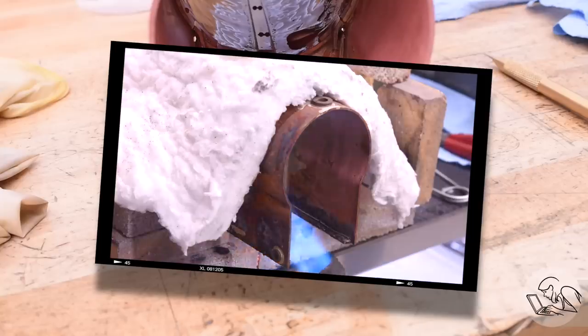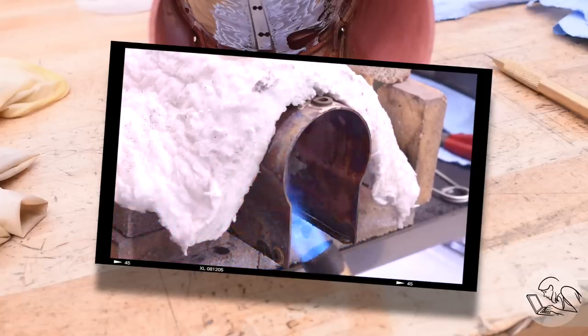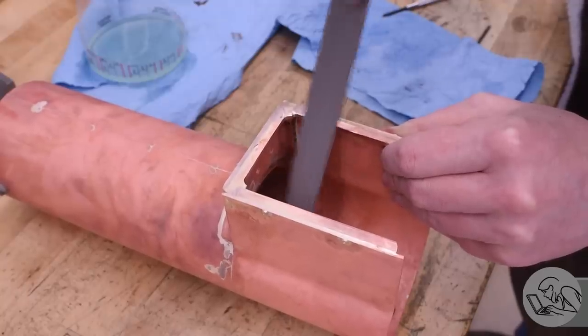Kozo doesn't recommend using insulation — he never says to do that. That's advice I've gotten from other boilermakers, which is why I've always done it. But now I see why Kozo doesn't do it. But then why use insulation at all? Silver soldering is a race to get the joint hot enough to flow the solder before the flux spoils. The flux has a temperature range within which it works, and you have to get into that range quickly enough — otherwise the flux is contaminated and the joint might fail. So that's why heating up the joint quickly is important and why insulation helps on large structures like this. It's also why I use the black flux on these large complex structures, because the black flux has a wider temperature range than the white flux does.